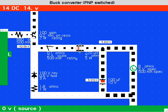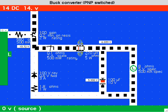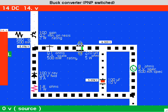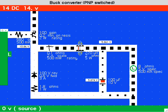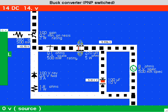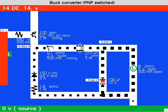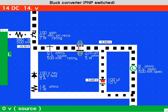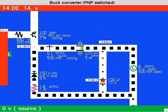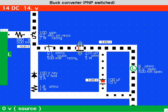The transistor shuts off and the flux field collapses. The coil propels current briefly to help maintain power to the load and filter capacitor. If the transistor were left on indefinitely, eventually the current will reach a maximum when the coil is offering only DC resistance. However, it is not the most efficient use of the coil if we allow current to stay at maximum.